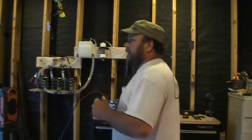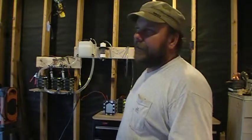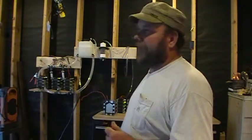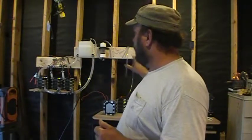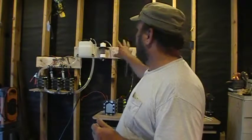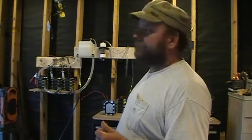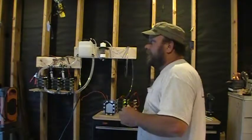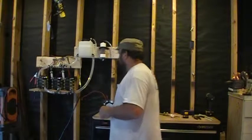And you definitely don't want to think you can fill up an LP tank and pressurize your hydrogen. Don't even try it. You'll blow yourself up and whatever else. But making it on demand is fine. Use your bubblers as your flashback protector, and don't put it under too much pressure, and you should be fine. Don't take it too far, that's for sure.